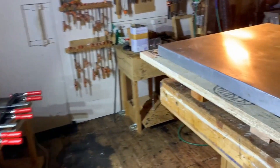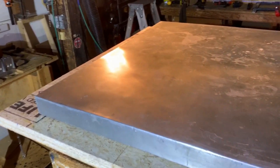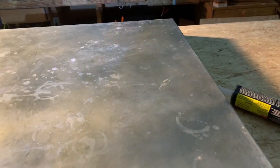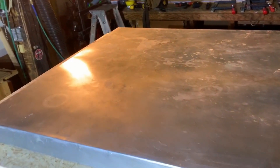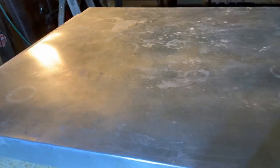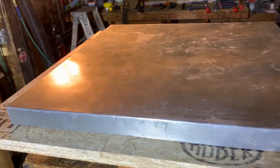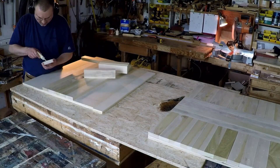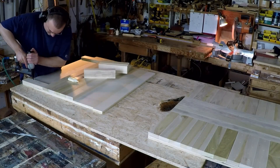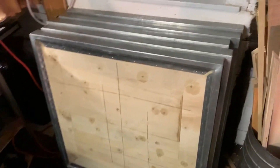Why did this happen? It's going into an extreme dry environment. My heated space isn't anywhere close to a big commercial building with a large boiler, which can be the extreme end of dry conditions. Basically the substrate changed dimension and shrank drastically due to changes in moisture content, while the metal did not. Zinc only changes dimension due to thermal expansion — if something hot is placed on the countertop or it's left in the sun. In this case, the use of plywood caused the substrate to shrink and that caused total glue failure on these zinc tabletops.